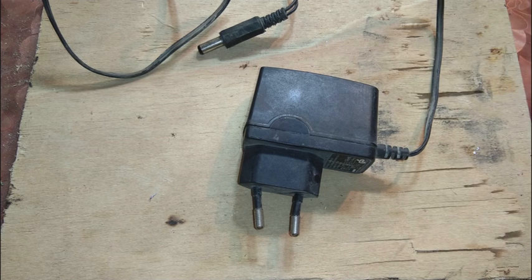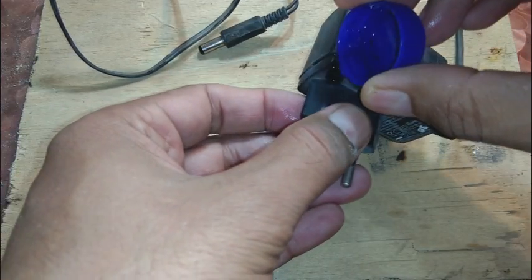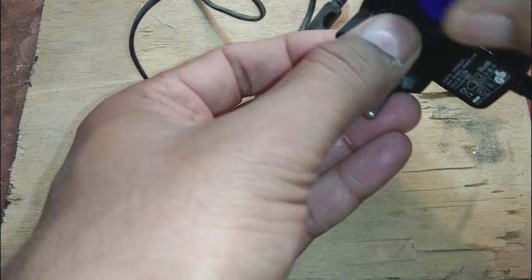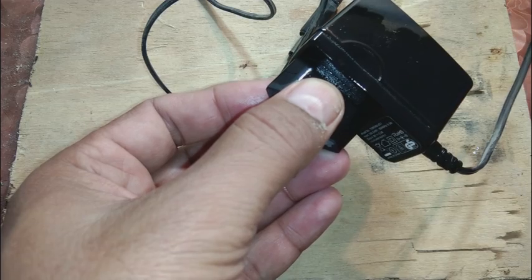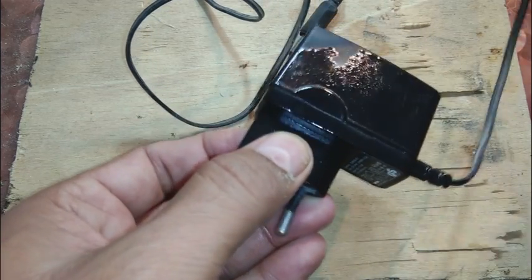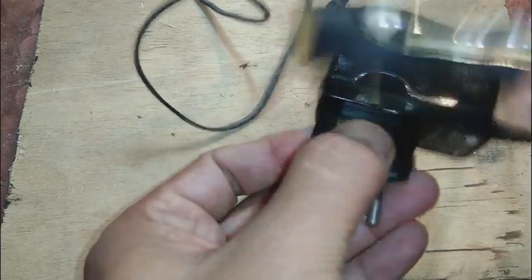I am going to break it down. This is a very straightforward procedure. I have shown it before — you have to put some gasoline or thinner on the body, on the joint, because these power supplies don't have screws nowadays; they are just glued.